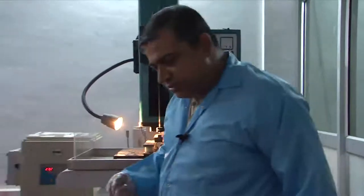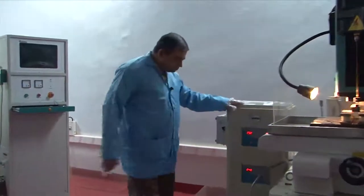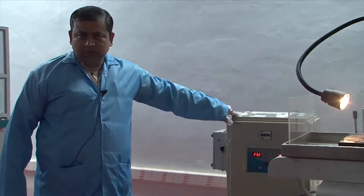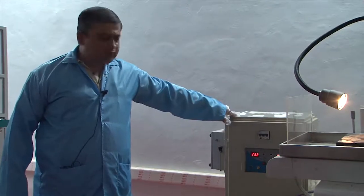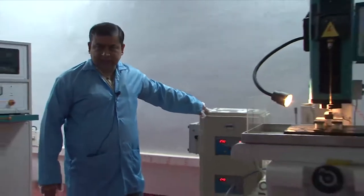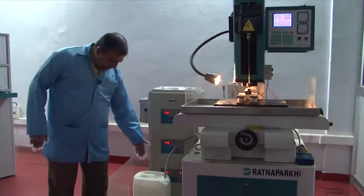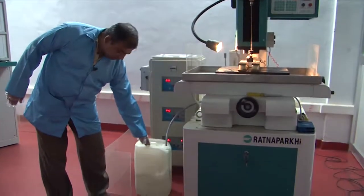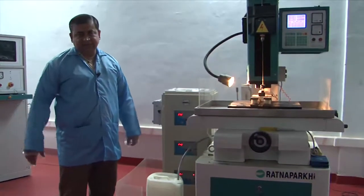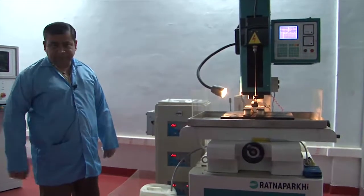There are other sub-units of the system. One is a stabilizer for the servo motor of the tool — it is very important for protecting the system from voltage surges and is designed to handle high voltages and protect the tool properly. There is also a unit containing the dielectric fluid, which is typically a water-based emulsion providing the necessary insulation between the tool and the workpiece during machining.